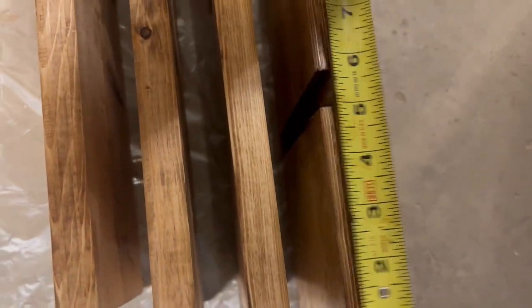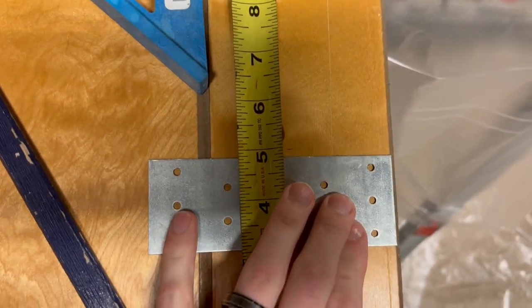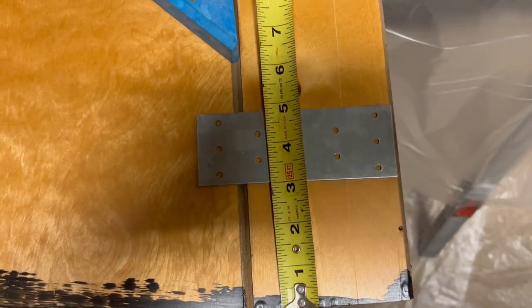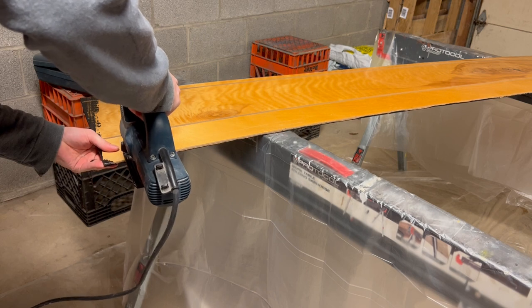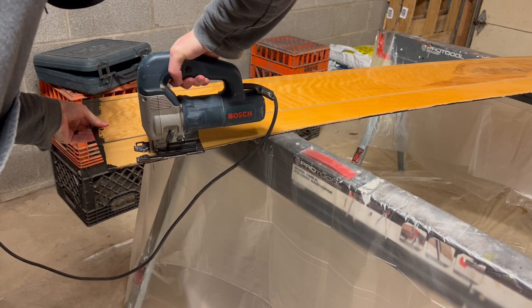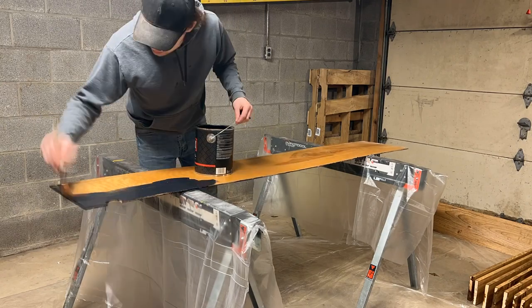And then this was actually a step that I've never done before. I'm basically going to be anchoring both of the shelves together. I just needed to cut a small hole on this back wood panel before I painted the other side of it. Basically I just wanted to use this little bracket to anchor the bottom of each shelf to each other, because the shelves are going to be back to back and I wanted them to be as strong as possible. All my shelves were designed to be up against a wall, and so since these shelves were going to be kind of back to back with a backing board in between them, I wanted to anchor both the top and the bottom to each other. So I'm using a jigsaw just to cut out a small hole on one side of the back board, and after I did that, I can paint that as well.